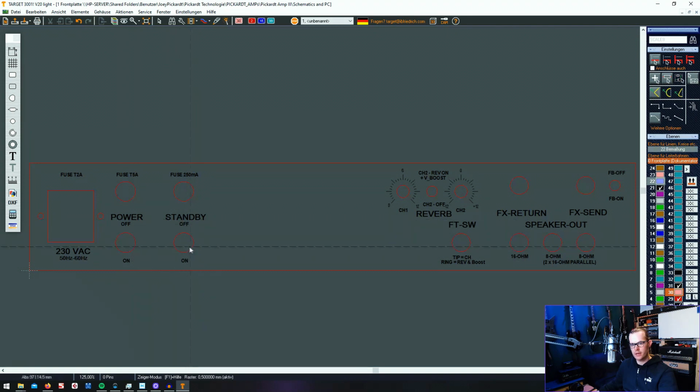It's nice to have it at the back because all the leads from the power transformer can be very short and are not moving that far into my amp and are not coming in the near of some signal amplification, so maybe I have less noise from AC 50 Hz signals into my audio circuit.